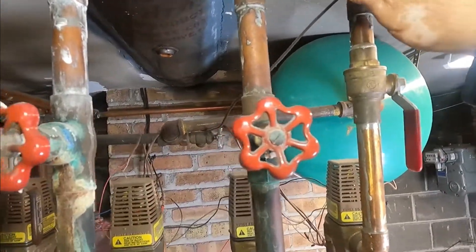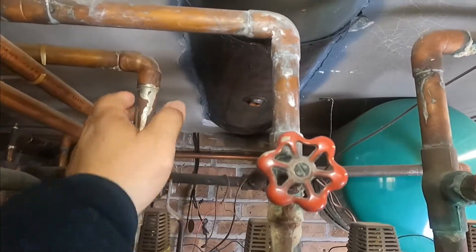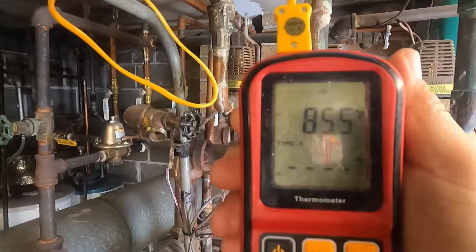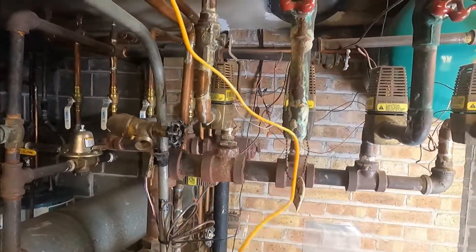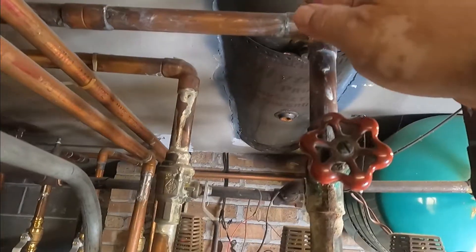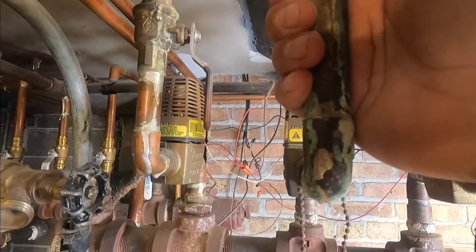I'm going to touch the pipes. This one is hot, this one is not as hot, and that one is hot as well — so this one is not too. That's about 85 degrees; it should be hotter. Now I'm going to put my clamp on the one that works and the temperature on this one is about 107 degrees and climbing. So this is about 30 degrees colder. That's why it's important that you touch, listen, smell.